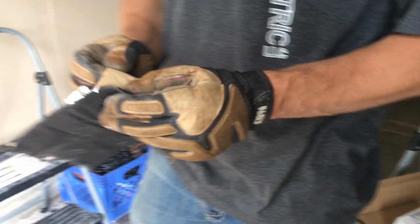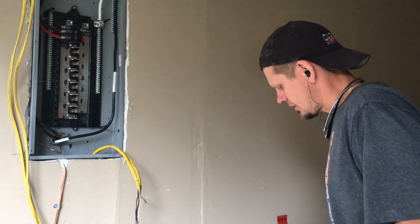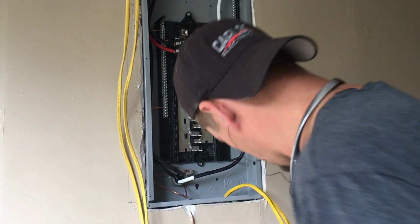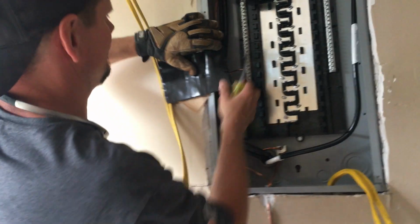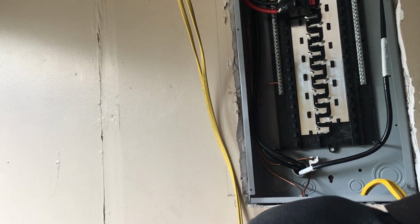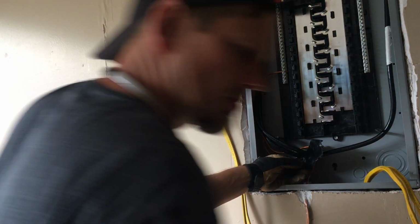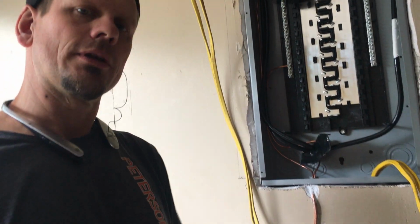Don't forget though, guys, one other thing. Because of Article 300, I think it's towards the front of it, where it talks about transferring between different atmospheres. You want to just get some rubber tape. It doesn't have to be fire retardant, but this stuff, probably should use a knife. Don't forget to use this, which this one we don't need a lot. And you need to stuff that inside of that hole the best that you can, because our inspectors actually look for that to keep out condensation is what they told me. Beyond the fact that if there was a fire, fire loves to seek out oxygen.